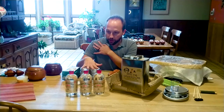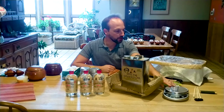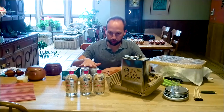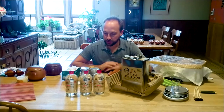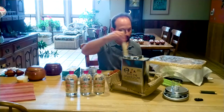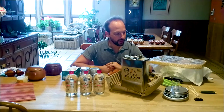And what we're going to do is probably pre-pour these. I think they're 2-ounce tins, so 0.8, 0.8, 0.4. That'll be our tins. I've got my kitchen scale here, a little measuring cup to measure it all out in advance. So I'll probably pre-prepare these with the linseed oil and turpentine, and then pour in the hot wax. And I've got some old chopsticks to get it all stirred and mixed thoroughly so that it gets a good mix before it dries and forms into the wax paste. So that's what I've got.